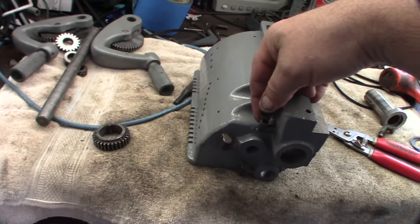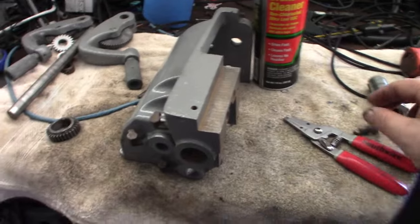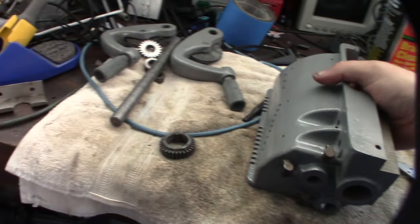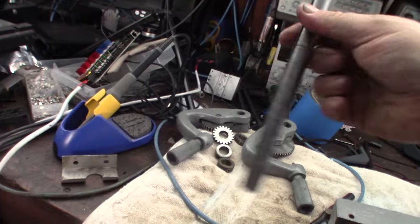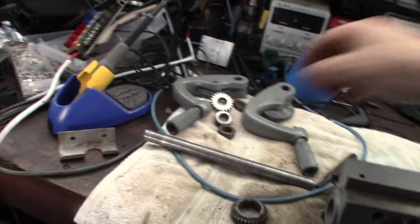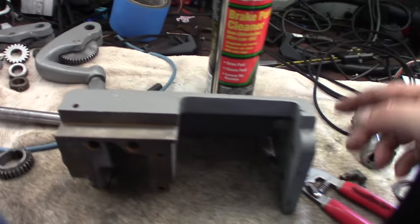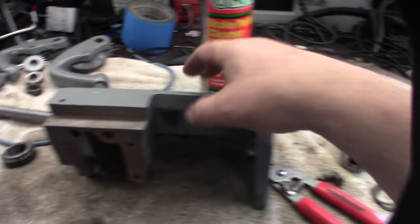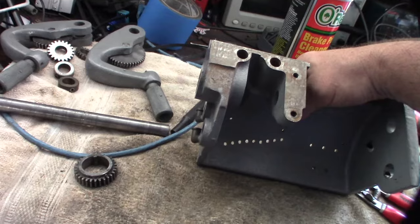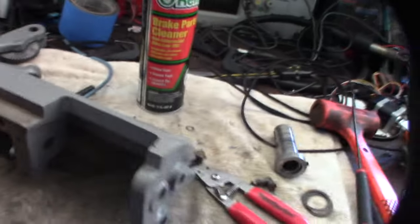These, I think they're called Gits oilers. You gotta check these things. These were completely clogged, so I don't think this thing was even getting oil. I noticed that so much on this shaft. I'm going to probably get some emery cloth and smooth it out a little bit. I can tell some of the shafts weren't getting oil. These were completely clogged with that weird cake grease that's in here, that sticky cake grease. So I've got to get those clean, free.